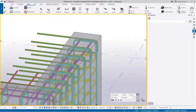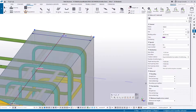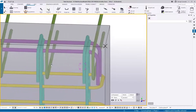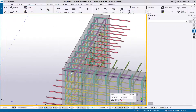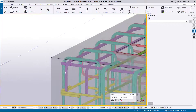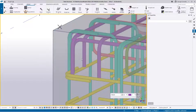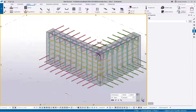Switch off the guide, then grab this edge holding control and drag this edge down to our 300mm dimension — whatever hook you want to insert. Tekla is smart enough to miss the cover. Grab the other bar, that edge, control, and drag this down. We can see we get a perfect cover there. Just like that we now have a good intersection there with absolutely no cover issue.